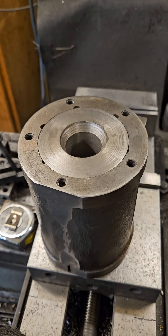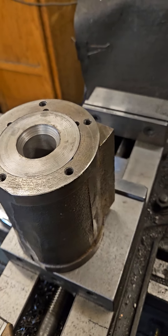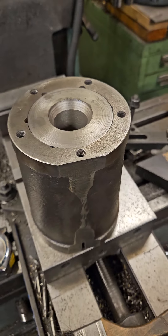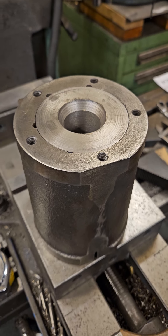This one had some problems — the cylinder had some holes drilled in it. So I brought it out to 3 inch diameter and made a liner for it. I couldn't find a liner, but I had a 3 inch cast iron bar, so I just made it out of that. Thanks for watching.